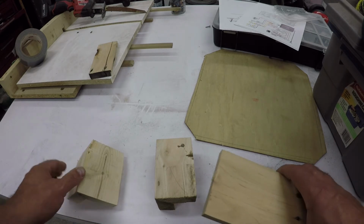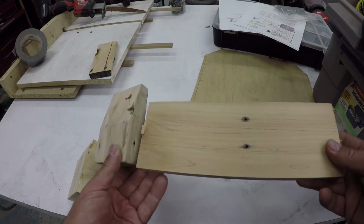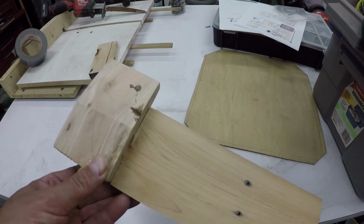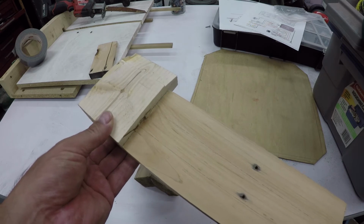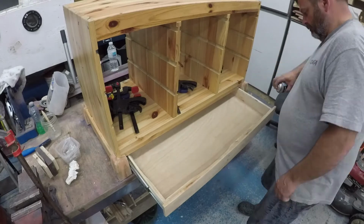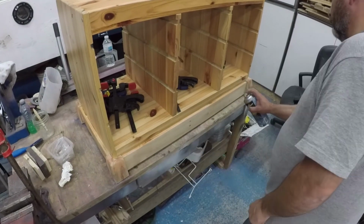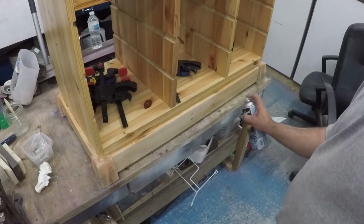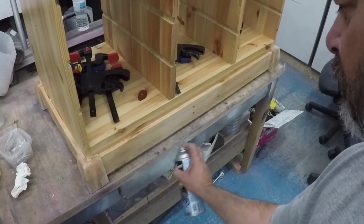My biggest headache was the corners. I did a 12.5 degree slot on it, and the face was again some more pallet wood, but I think it was hardwood, and I think it was birch, not sure, birch or maple. I did a few pieces to test. Once assembled, I gave it a coat of varnish to match the pine that was there, and I'm pretty happy with the finished product.